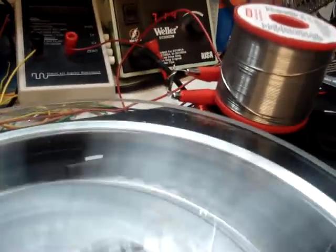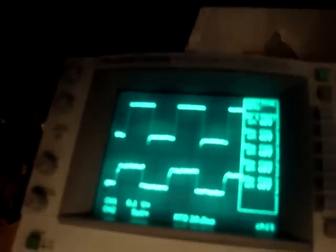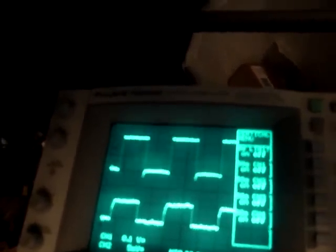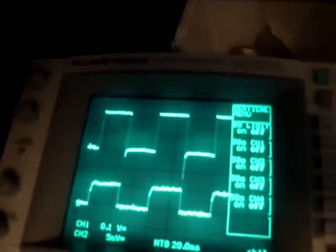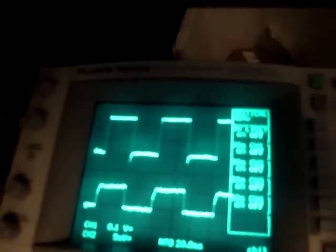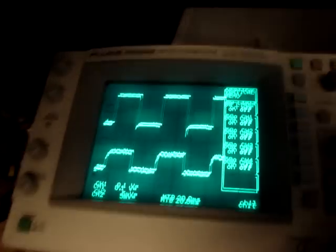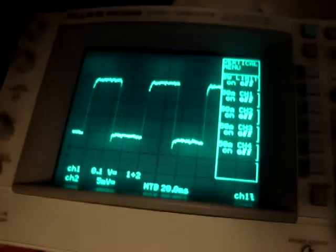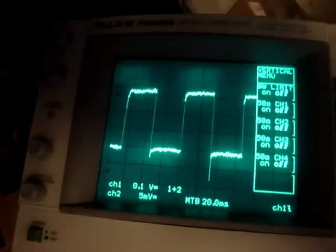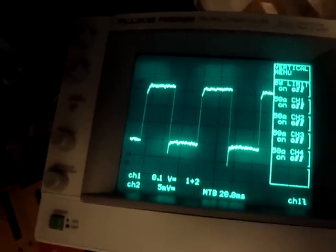It's hard to show you the offset, but most interesting is the waveform. This is one coil, nothing special, running at about 2.2 volts. The top trace is the voltage across the coil, the bottom trace is the current through the coil, and if I add these two together you can see the overall picture of what's going on current and voltage wise.